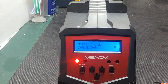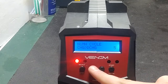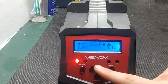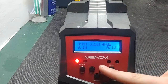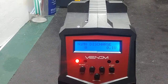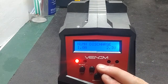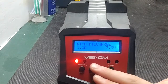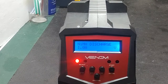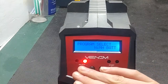You can also discharge this battery. If it's fully charged and you want to discharge it, you change the amperage as high as it will go, which is one amp. You can discharge batteries at one amp — it takes a while, but it's worth it. Then you change the voltage to match your battery, so for a 7.2 volt battery, you'd set it accordingly.